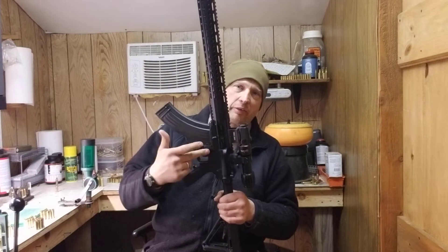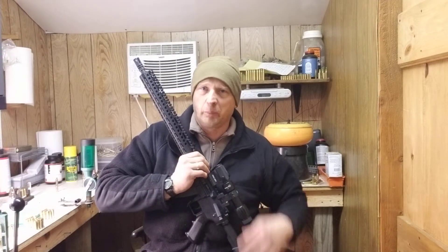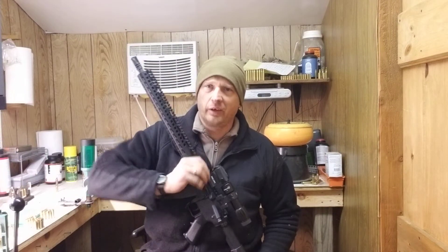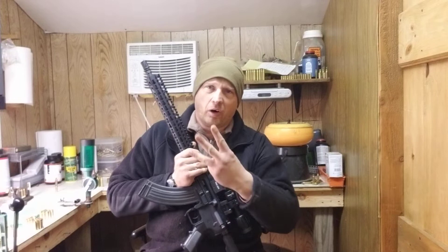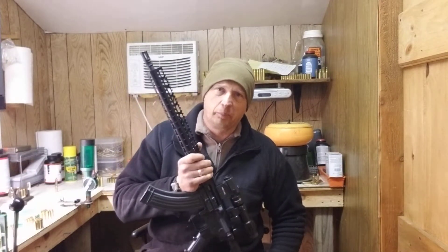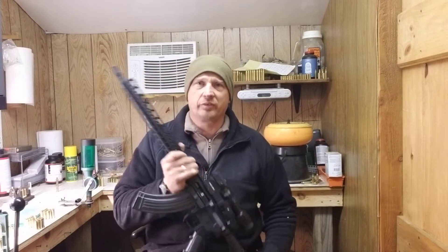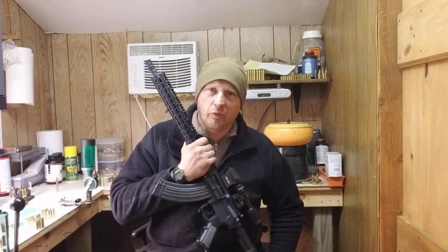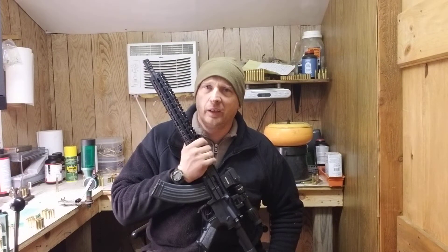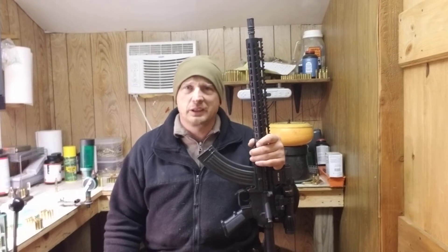The lower is different than a typical AR-15 lower. What I didn't know because I didn't do my research is that the bolt carrier group is completely different than a regular AR bolt carrier, and the upper is also completely different — you can't use a regular AR-15 upper either. So you've got three parts that are not AR-15: the lower, the upper, and the bolt carrier group. If you want to build a KS-47, I'd recommend buying the builder's kit which comes with these three parts — everything else is AR-15 — or buy the complete lower and later buy a complete upper from Palmetto State Armory.